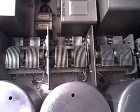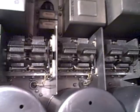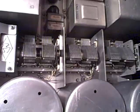It has a fairly large tuning condenser — as you see the plates move, this is how you tune in the radio station. I want to make sure I'm getting good video of the current components. This is your tuning condenser, very big compared to the little square white boxes you see in transistor radios. This receiver weighs about 100 pounds. I think this is the input and output transformer, and that's the power supply transformer.